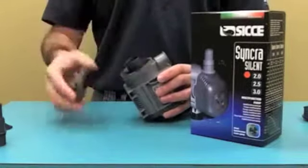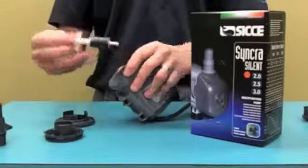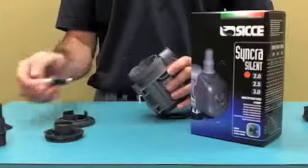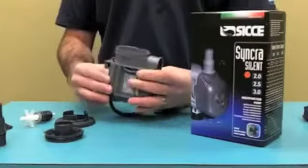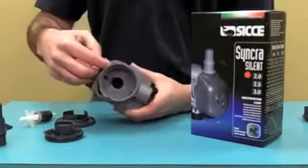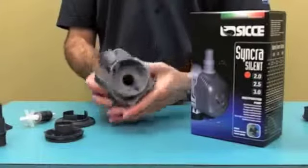Some other unique features of the pump: it's all ceramic — ceramic bearings, ceramic seats. The impeller is of the highest quality. The shaft is fixed, so all the vibration and noise from the pump are removed. Every feature on it has been thought out and designed for a specific purpose. The slots you see, the ribbing you see here — this is designed to pull water into the pump, keep the coils cool, and out of these holes, so you actually get circulation of water around all of the pump motor to keep it cool.